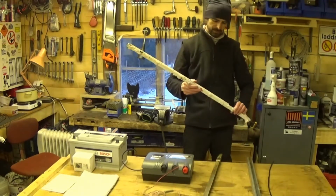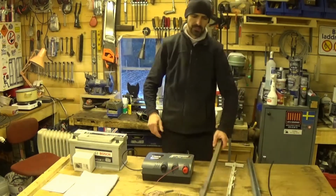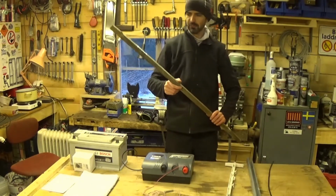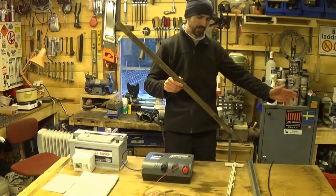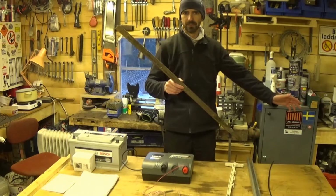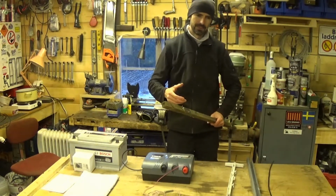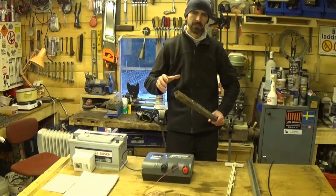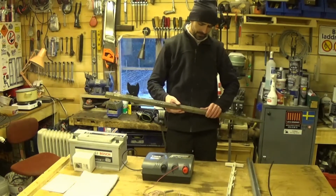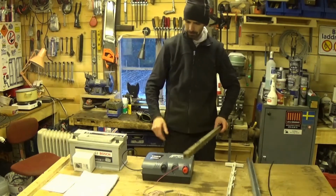If you're using these plastic toy things, then you don't need an isolator. If you're using a wooden post, any sort of wooden post, whether it's one of these sort of Mickey Mouse things or a proper post, you need an isolator. And you need an isolator because, well, wood conducts electricity. Wood doesn't conduct electricity, but damp wood does conduct electricity. And yeah, it's quite often damp.